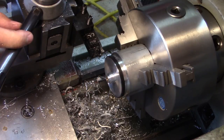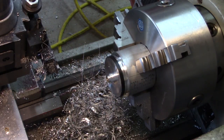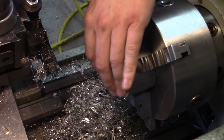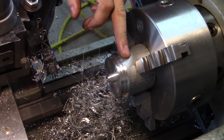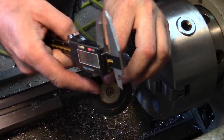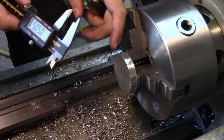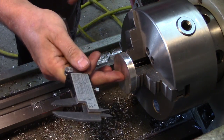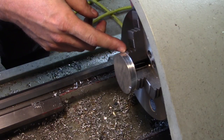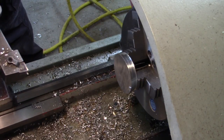After some fitting and fiddling, I got 2.232 - within 2 thousandths. Especially considering the fact I'm taking measurements on a piece of rubber, I figure 2 thousandths is close enough tolerance. We're going to cut it off in the band saw because quite frankly I don't trust parting that deeply - it's liable to end badly. From outside ridge to outside ridge, we're about 260 thousandths of an inch. What I'm going to do is just face this side and keep facing down until this disc portion - the thick portion - is about 260 thousandths. It's got some support because it's right up against the jaws, but I have soft jaws in there so I'm just going to have to take light cuts.